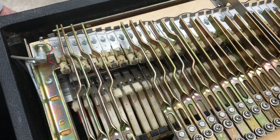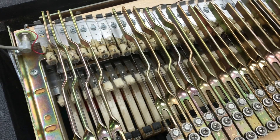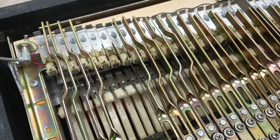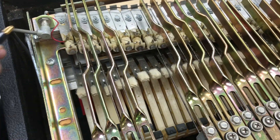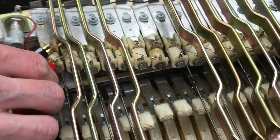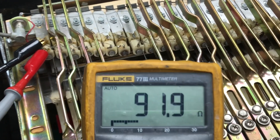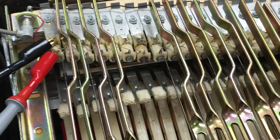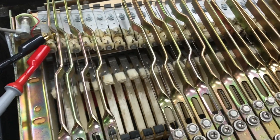This is a Mark II 73-key white pickup piano that currently has no output at all. We're assuming there are a lot of dead pickups and need to find them. The first group, as we know from our chart, is a group of four pickups that should measure 45 ohms. It's measuring 91.9 ohms, which tells us that we have two open pickups in this group.